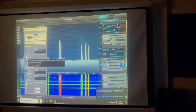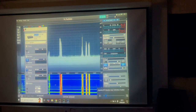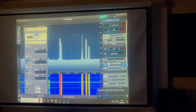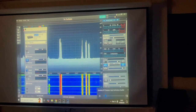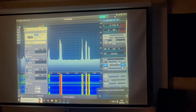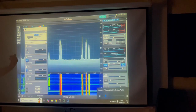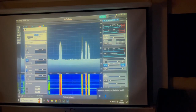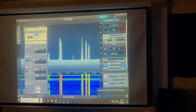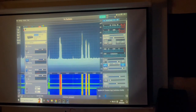So I don't think it's going to show us anything until I transmit. But yeah, it'll take whatever audio input you want, and then you can set up extra audio inputs. If you're running some processing tools for audio on your laptop, like a compressor or an EQ program, feeding it through something to make you sound like Donald Duck, you can feed it into that, and then you can feed the output of that program into the radio, and it will just send what you send it. So that's how it works with things like WSJT-X. You just tell WSJT-X that its sound card is the Flex, and that's it.